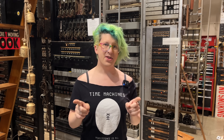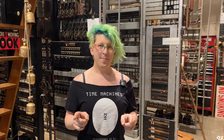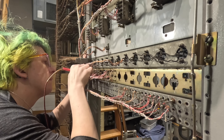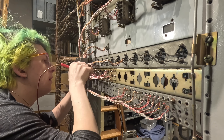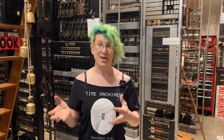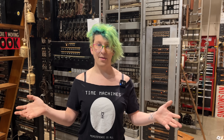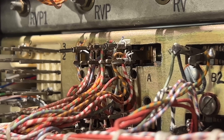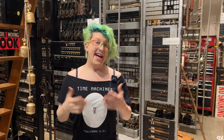But then I found a more serious problem. Remember that new relay that I got from storage? That's not working at all. There's battery at one end of the winding, but when I poke the other end with ground, I don't get a click and the relay doesn't operate. That tells me that this winding is open somewhere — especially frustrating for a relay that was new old stock and still in its original box. At this point I've got no choice but to remove it and try to figure out what's wrong. This is pretty annoying because the terminals on this one are wire wrap, and wire wrap does not like to be undone.